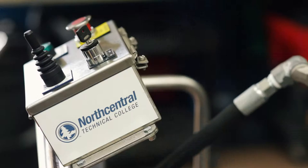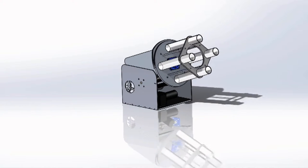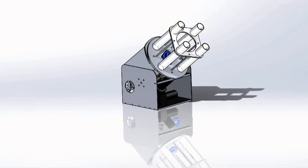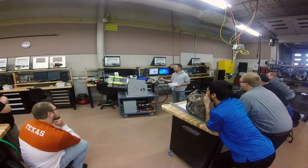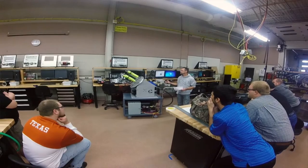At the end we all came together in the electro-mechanical program. We did all the solenoids and the actuators, the motors, the chains, the hand controls, the drives. We integrated everything using our PLCs with downloading the program and some sensors to see if everything was actuating — a little trial and error.